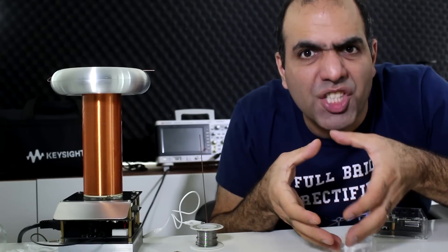Now it's time to install the power full bridge rectifier. Here's another awesome usage of the full bridge rectifier. Originally we have our ground connected and AC comes in; if we measure the output we get bumps, and adding a capacitor gives us rectified DC. Now if we move our reference ground and measure the two output points, we get positive bumps and negative bumps respectively. Adding capacitors between these points and the reference ground gives us a positive DC supply and a negative DC supply. In the OneTesla design, 120 volt AC input has 170 volt peaks, so we get positive 170 volt DC and negative 170 volt DC. Isn't the full bridge rectifier just beautiful?